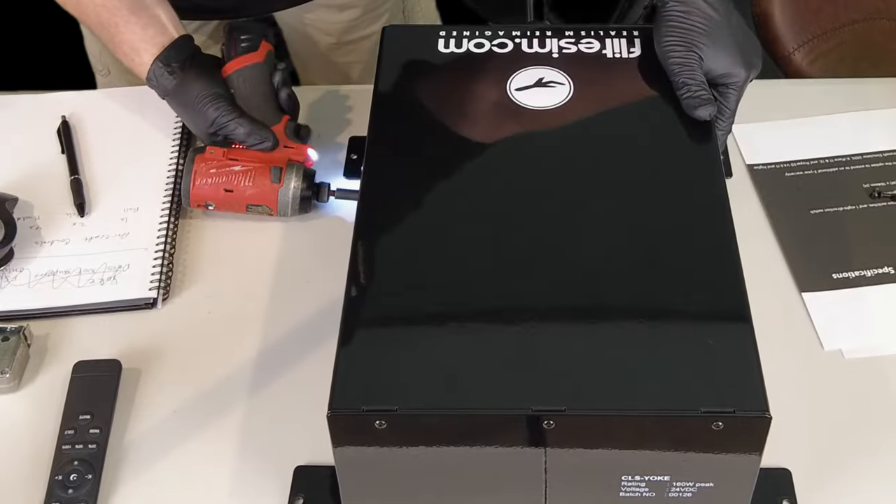For those who may need to replace the roll motor, either with an upgraded or replacement motor: the motor is attached to a 6-millimeter bracket that is separate from the bracket on the unit itself. On the bottom of this bracket, it bolts to your mainframe using elongated holes so that the whole piece slides back and forth. Fabian has also included a tensioning screw that will pull the entire assembly to one side, allowing you to tighten up the three bolts underneath to keep the bracket secured in place. After tightening the tensioning screw for the belt, tighten those three screws underneath to secure the motor.